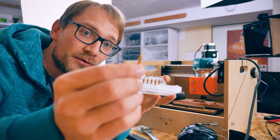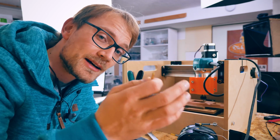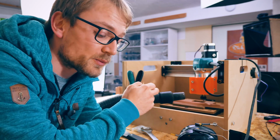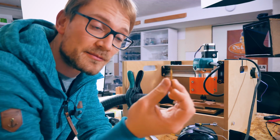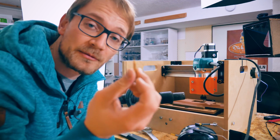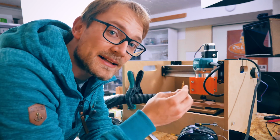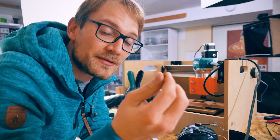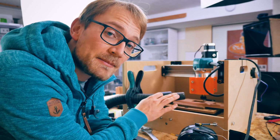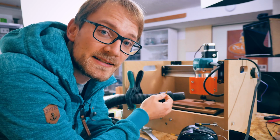These are made for PCB milling, but I think it's more like outline milling and not copper isolation milling, which is what we're doing here. Still, I compared the size of the 0.5 millimeter cutting edge here to the trace width we're already getting, and it looks like the isolation trace we're cutting is already at 0.5 millimeters, so we don't have much to lose. I'm gonna keep the machine in this position and just mill over the existing isolation traces again.